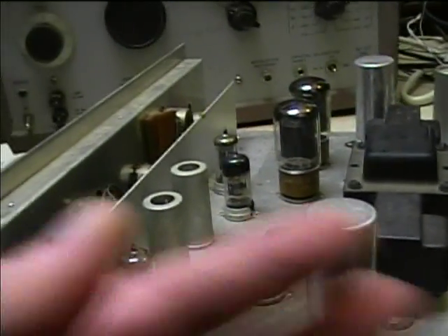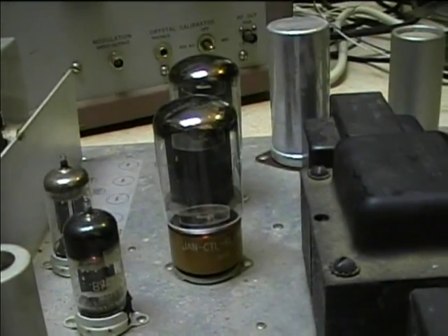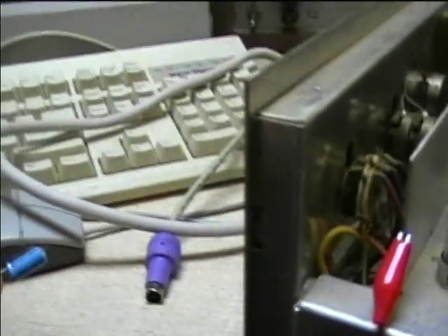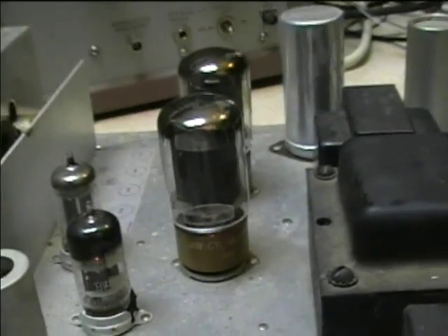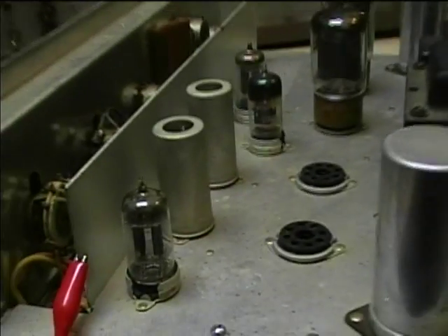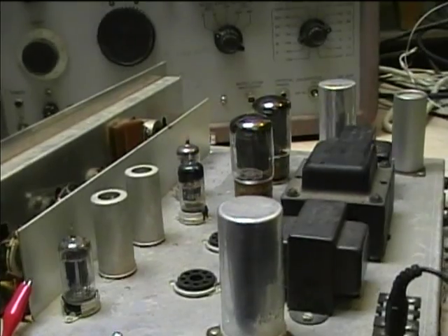The last time I had the problem, just a little while ago, I noticed there was some hum in the speakers, then this tube's filament started glowing really brightly, then there started to be arcing and the plate started glowing red on one of the 6v6 tubes, and finally we saw smoke - this electrolytic capacitor had burst open and started smoking. I think there was a short in the 6v6 or 7408 from the screen grid to the cathode. It burned out the filament on this tube and unfortunately I think it went back into the phono cartridge and burned out part of the phono cartridge.